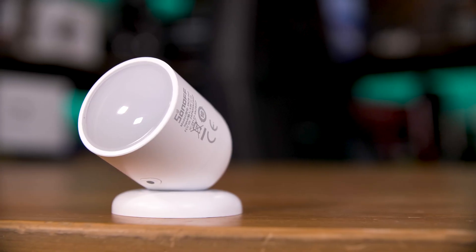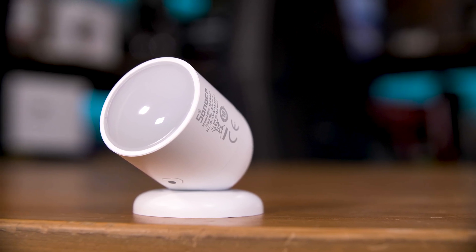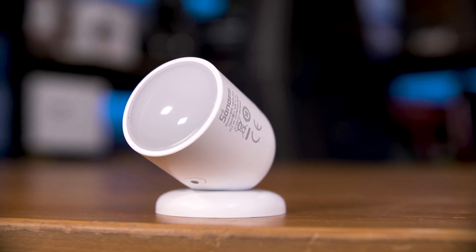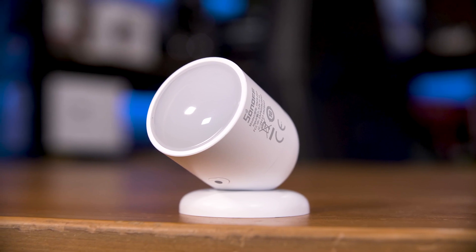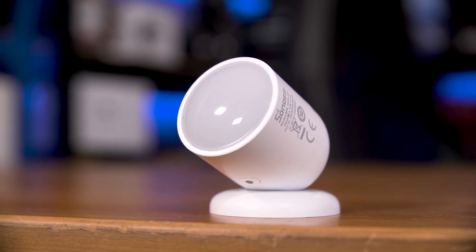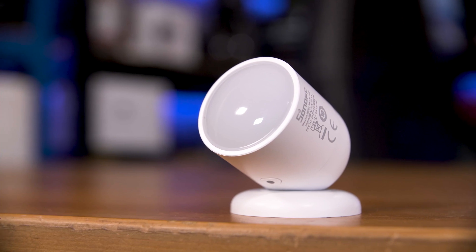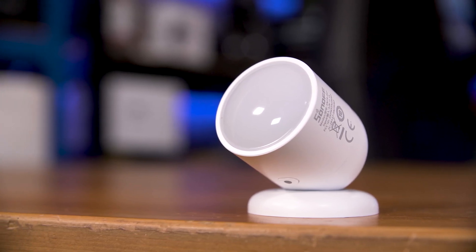So what's different with a presence detector? Despite this looking remarkably similar with its own clear dome lens, this works completely differently — it uses radio waves. This one in particular uses 5.8 gigahertz waves, although some use more like 24 gigahertz or 60 gigahertz to detect even the tiniest of motion. This is literally radar for your home.